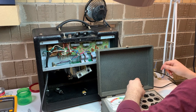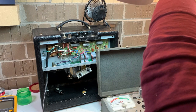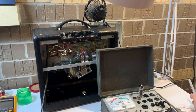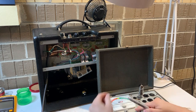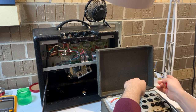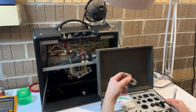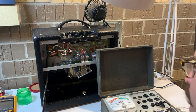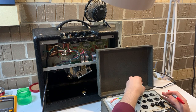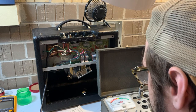I like to test them left to right so if I find an issue with one, I know exactly where it came from. Tapping the tube is a good way to agitate it — if there's a short that's not extreme, tapping will usually make it short. It's much better to do it on a tester than inside your amplifier. That one's actually shorted, which is why I kept hitting it so long. Once I see the short bulb light up, I usually want to recreate it just to triple-check my eyes aren't deceiving me. In this case, they were not.